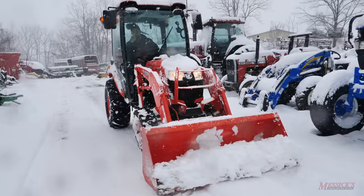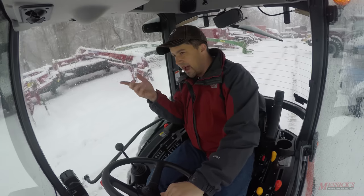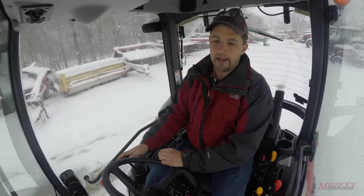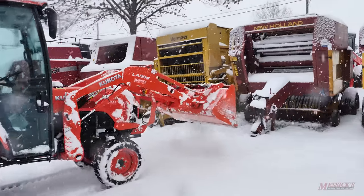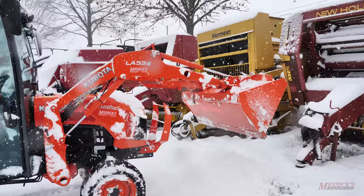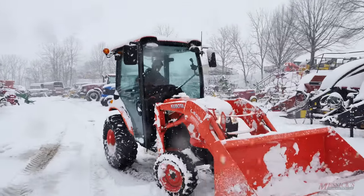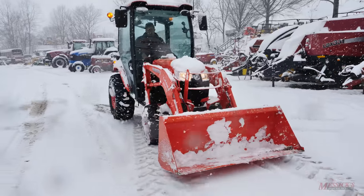Just run along and skim the snow off the top. Our guys were through here with skid loaders earlier this morning and took most of the snow off, so this is what I've got for a demo right now. You can see here when I dump — I came around and picked up a little bit of stones in the corner — but for the most part, that snow is a lot cleaner than had I gone and crashed through this with my loader cutting edge on the ground.